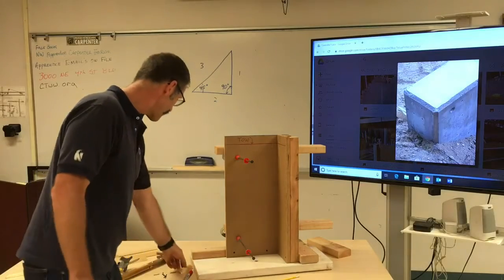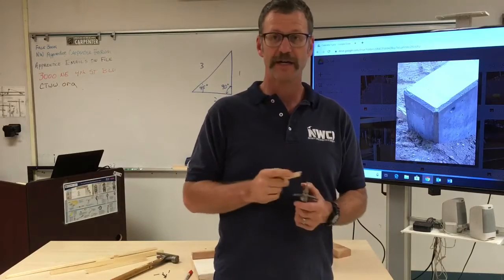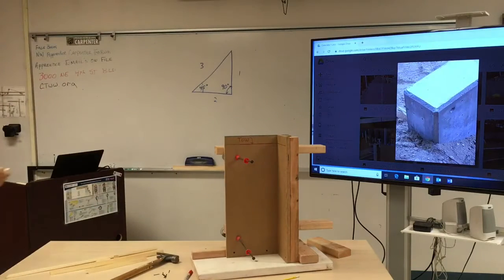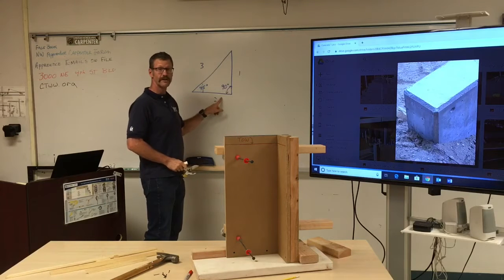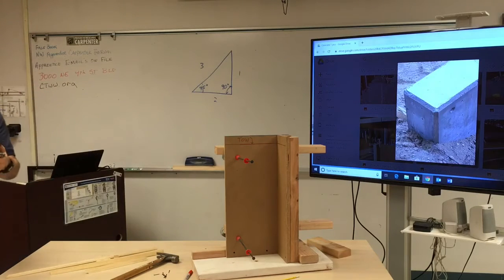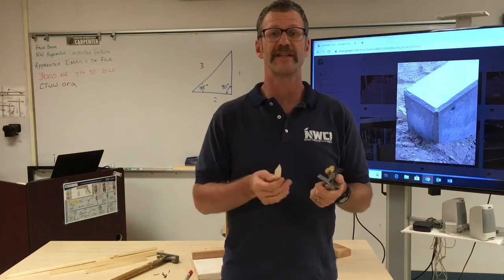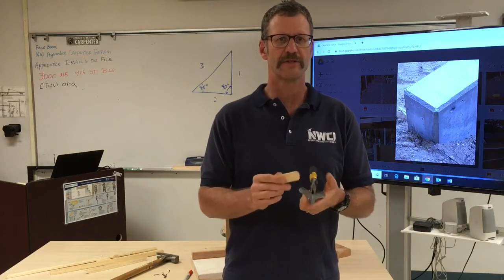That thing used to kick my butt until a journeyman showed me how to position this chamfer in my cutters. There are three different sides to this chamfer. Two of the sides form a 90 degree. The third side always forms a 45-degree angle to those first two sides. So there are three different sides you can position in your cutter, and I think that's where my frustration used to lie, because I couldn't remember whether it matters which side I place on there.